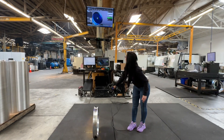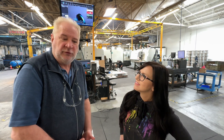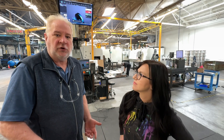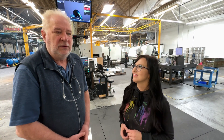What we have going on here is laser scanning the part to determine its dimensional accuracy against the drawing. Once the part is turned, you bring it over here and use a laser scanner to scan the whole surface of the wheel, which takes about a minute. At that point, you have the whole part digitally represented, and you overlay it against the drawing to determine that it's correct. It captures thousands of points. This is opposed to the old method of using height gauges and calipers to physically measure the part, which takes a long time and is not nearly as accurate. The laser takes thousands of points per second, giving a full graphical representation. At this point, the product is ready to be shipped to the customer with 100% certainty that it's dimensionally correct.